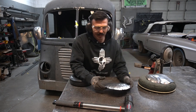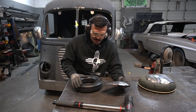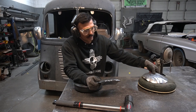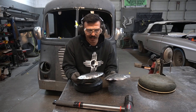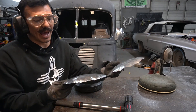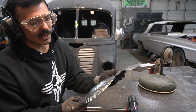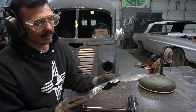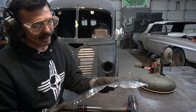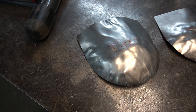As you can see, this panel is just a little bit smaller than what I should have used — this tire is a little big for this panel. But you can already see the difference in stretching and shrinking with this thing. Since we got those spontaneous tucks with the tire and we weren't able to get those with the sandbag, we've got more curvature with the tire than we did with the sandbag.